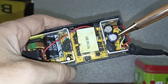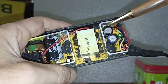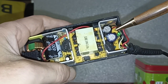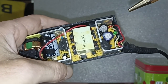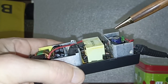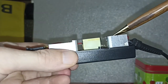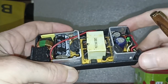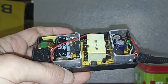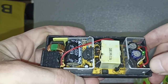I replaced them with the same capacitance but a higher voltage value — the voltage must never be lower. The capacitance can also be higher than the previous value, but you have to look at the physical size as well — you want your cover to be able to close properly with no capacitors sticking out.